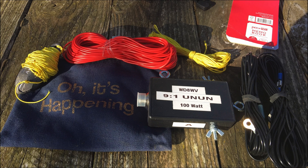In addition to the Wolf River Coil clone antenna, he also has this 9-to-1 unun. The red wire is the radiating element for the unun and the black wire on the right is the counterpoise. He also has a sinker wrapped with some mason line, which he uses if he needs to get wire up into a tree. He can set the 9-to-1 on the ground, take the other end of the radiating element, put it up in a tree, and run it in a sloper configuration.